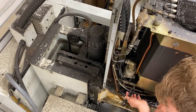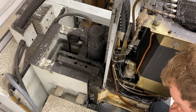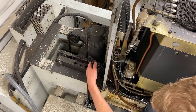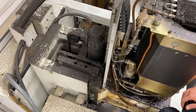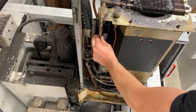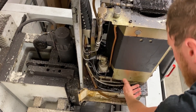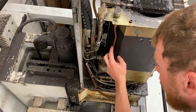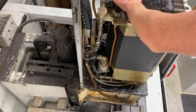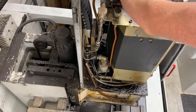This machine has been used hard and put away dirty. While you're up here, you can also look at the switches and the rollers, the motor for the tool change, and your Z-axis linear trucks and ball screw. Remember those hydraulic lines that lubricate the transmission — I can tell one has been replaced here. There's one that goes from the bottom of the transmission all the way up and around. The other one is original — I would replace it if you're gonna be running this machine in production, because it's a big deal.